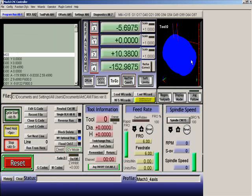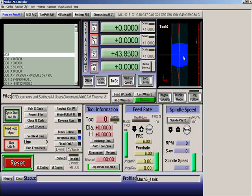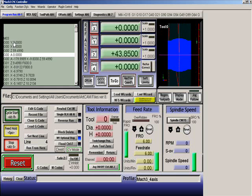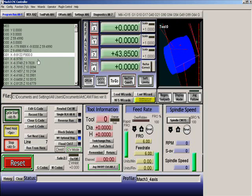You can see we're not zero on anything. The very first thing you want to do is set up your wax left to right, top to bottom — your zero points — and zero out all of these. When you zero your Z, get it down to zero and then raise it up out of the way so you can put your wax in. Looking at the G-code, the very first couple lines show Z is up out of the way. It goes to A-zero for its reference point, then goes to essentially minus 180 degrees. X moves over to the start point, which is where we told it to constrain our toolpath with the vector, and your A-axis is going to increment whatever the step over for the tool was.